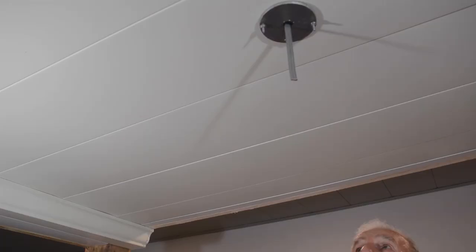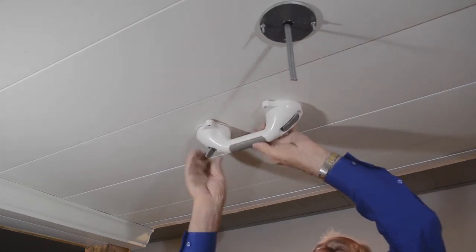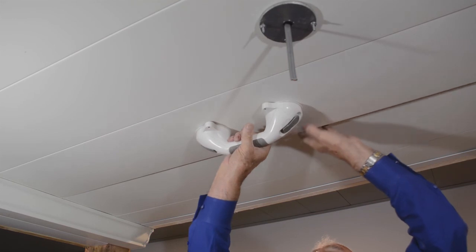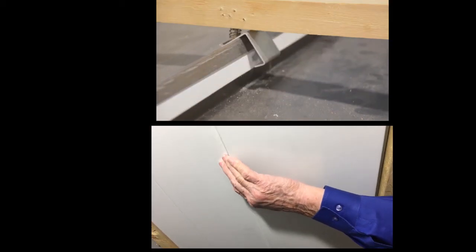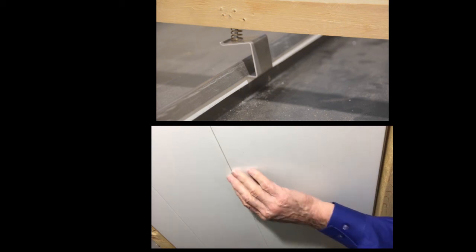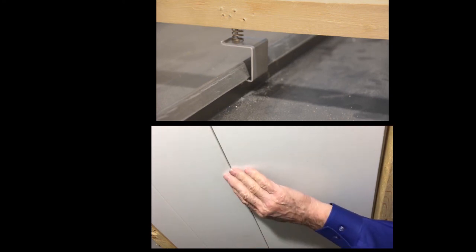Remove a sealing panel. Attach a suction cup to the panel you wish to remove. Push the suction cup up together with the panel that was installed after it. Relax the lift on the panel with the cup while holding the next panel up. This position shows the panel released and ready to remove. Engaged. Released.